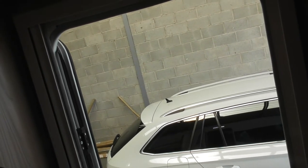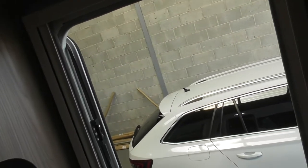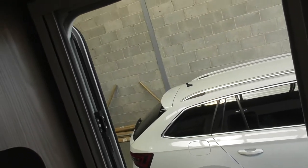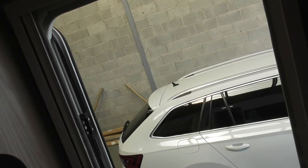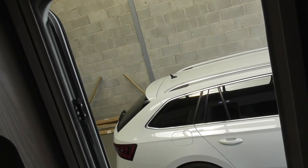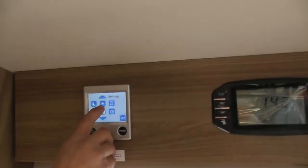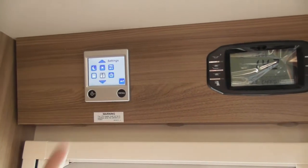That one is a nighttime timer, a reduced temperature timer, as it's called. What you can do is set a lower temperature for overnight. It won't reduce the temperature; it just drops naturally, and then it will maintain it at that temperature overnight over a timer. At the end of that time, it will revert back to the daytime temperature that you've set. That one there is a 7-day timer.